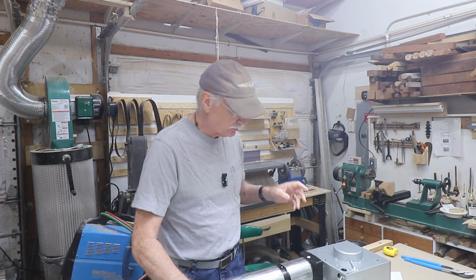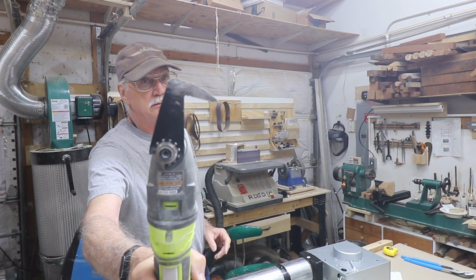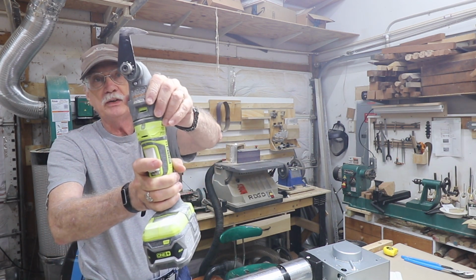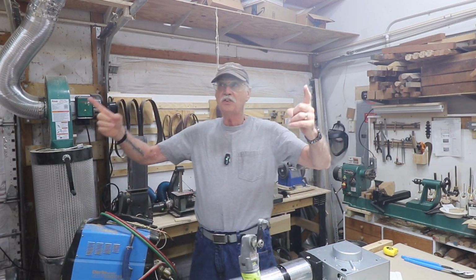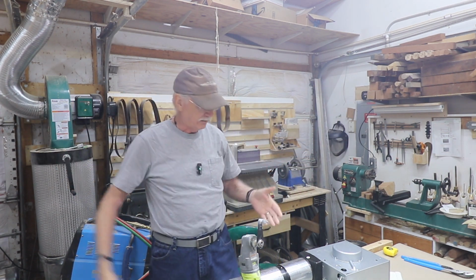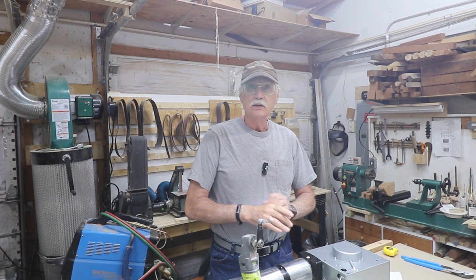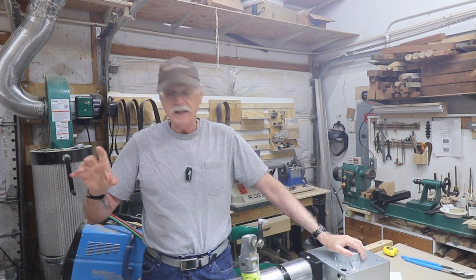The tool I was talking about for cutting the ceiling open is this. This is a little angled cutting tool for drywall. It has teeth up around here and around this corner, and has teeth under here, so you can put yourself up into the thing, turn it this way, and just run along how you want to cut it. What I want to do is cut to the joists on either side, this way, and about 20 inches in length. I've got a piece of drywall for patching the hole that's 24 by 24. The Home Depot, whatever, sells 24 by 24 pieces of drywall in various thicknesses as patch material.